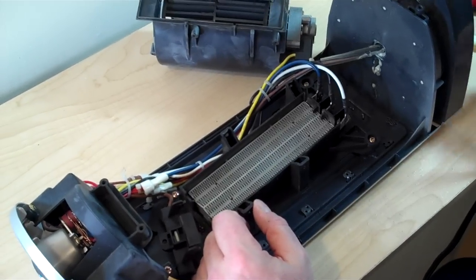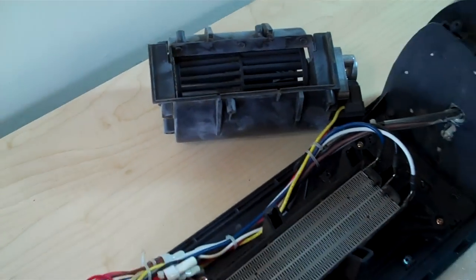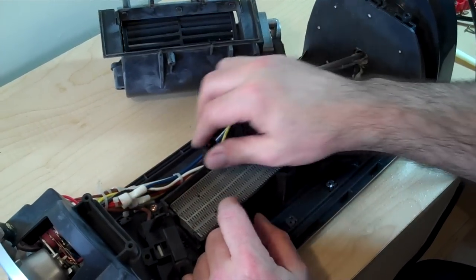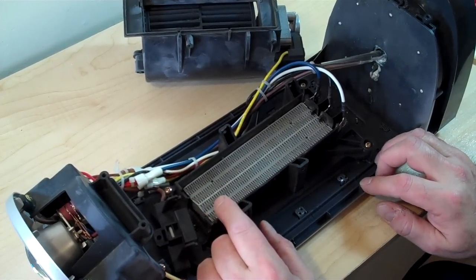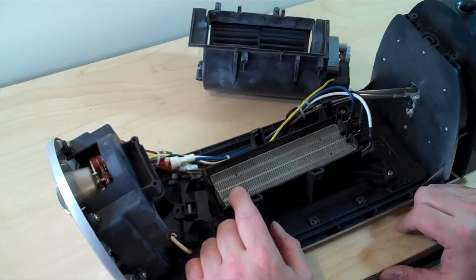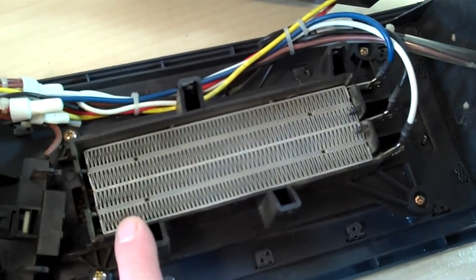It'll save you thirty dollars on buying another heater and make it more efficient. If you're not sure if it's dirty, hold it up to the light — you can usually see through it. Now on the square ones, they've got a square ceramic element with four tabs. You'll probably want to get somebody to help you because some of the older ones are brittle. Use two screwdrivers and two people to get those tabs out so you can remove the element and blow it out. It's a quick, easy project that saves you money, makes your heater more efficient, and works on pretty much any of these heaters. Give it a try — have a good one, bye.